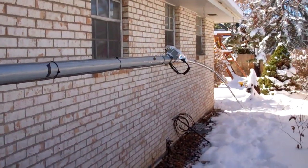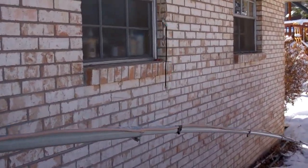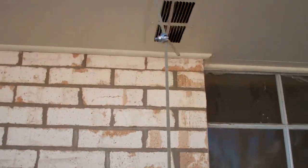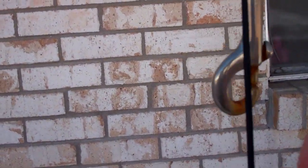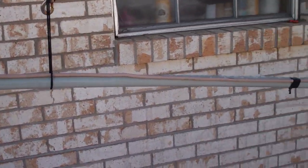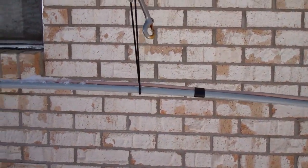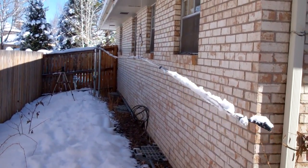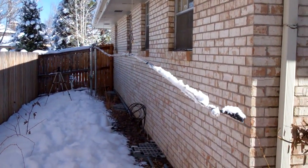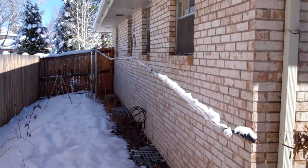Right now the antenna is completely cranked down and sagging on the ground. To support it when not in the upper position, I use a hook eye with a small steel cable and a bungee cord which hooks up to support the antenna. I have one farther down on the far end and do the same thing. This supports the entire antenna and keeps it from sagging on the ground. Basically it hides behind my fence — you can't see it from the front of the house. The cable system keeps it from dragging on the ground and out of the way of kids and dogs.